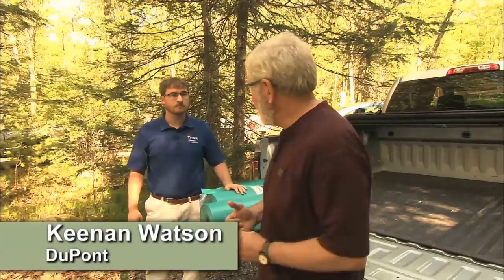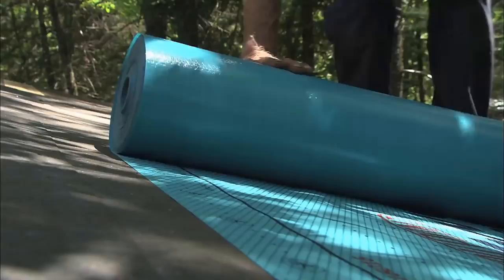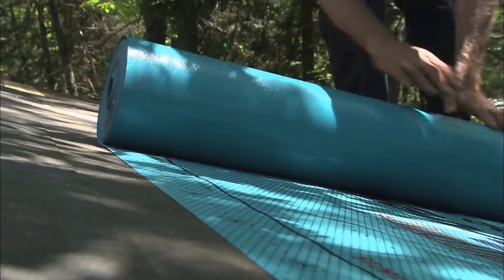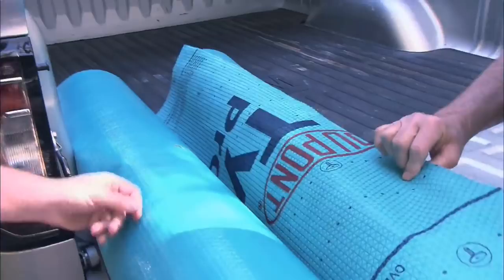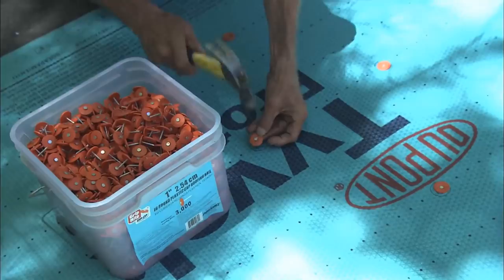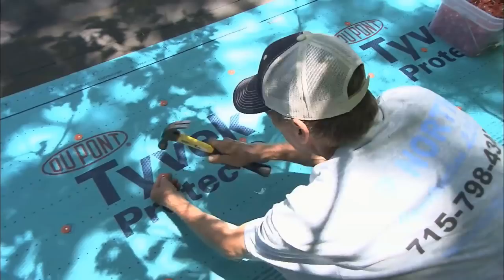I have Kenan Watson here today to talk about the underlayment we're going to be putting on the roof. Kenan, this is quite a bit different from the thirty-pound felt we put up about thirty years ago. That's right — this is a new and improved synthetic underlayment. This is our new line within Tyvek, moving from the walls onto the roof. Installation is no different from any other roofing underlayment. There's a print plate on top showing the installer where to place the caps and staples. We recommend cap staples or cap nails, and you overlap it up to this line — bringing on the next layer for strength and watershedding.